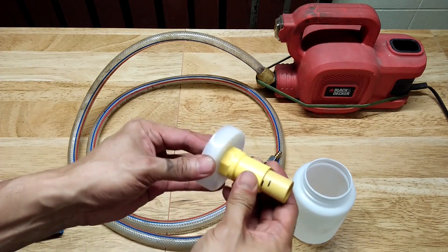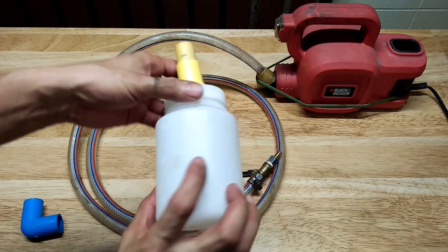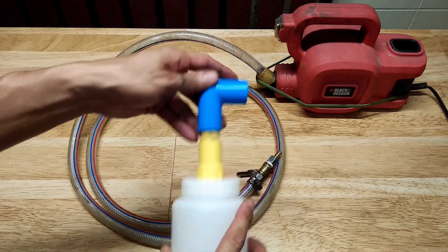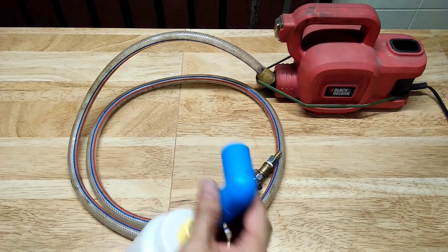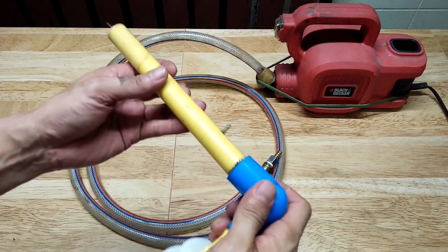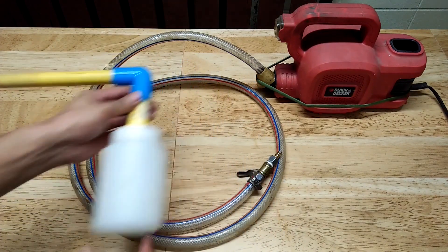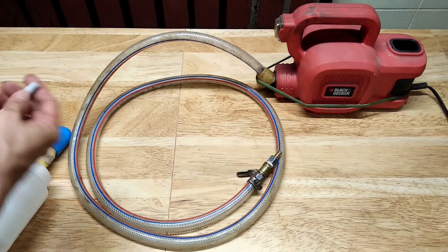This is one of the plastic jars that I prepared for my powder coating gun. The jar cover has this PVC bulkhead fitting used in home electrical installation. With that, I can connect this PVC elbow and nozzle of the previous gun.